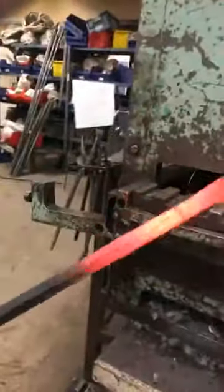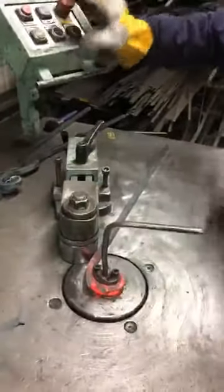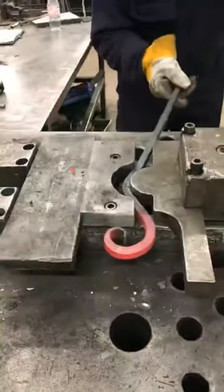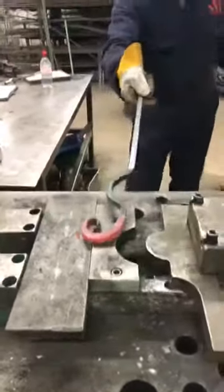12mm square, same again, but I'm just going to flatten the edge on this just once — straight flattened so it's down to a taper. Then we go straight over here to the scroll machine, which is what I've just been slowly designing. We'll get that round, then put it into another press tool over here. That just goes up to the end there, slowly press that in — boom. Give it a bit of a notch so it's not level, then quench that off.